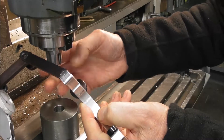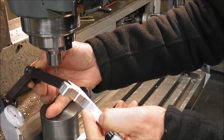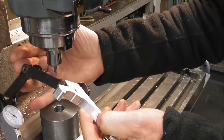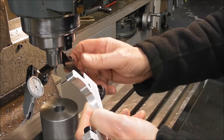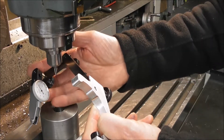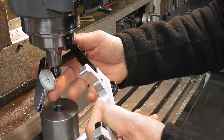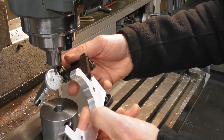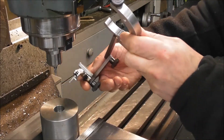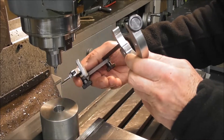Hopefully I've added to the collective knowledge with a couple of refinements: adjustable friction pivots so that you don't have to fiddle around locking and unlocking — which in itself was a problem because that generates movement of the dial indicator — and because the links are rectangular, it only needs to be adjusted in the radial line and doesn't have to be adjusted sideways.